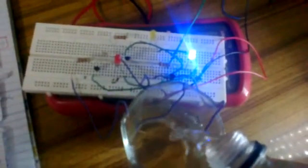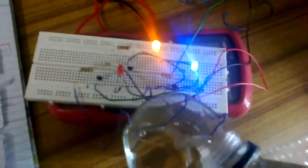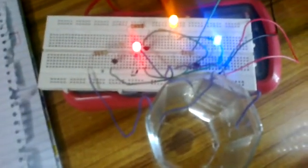I'm putting water in the container. As the water touches point A, the blue LED goes on. When the water reaches the output terminal of the yellow LED, that LED goes on. When it's full, the red LED goes on. You can name the levels anything, substitute a buzzer for any LED, make any number of levels you want, and the output can also be used as input to a microcontroller to build a digital water level detector. Please subscribe — thank you.